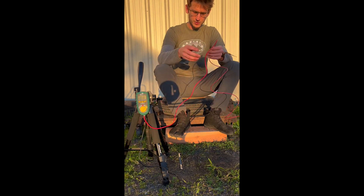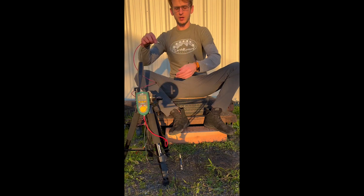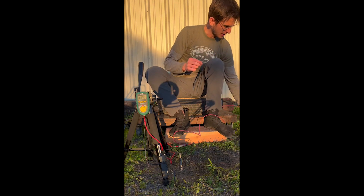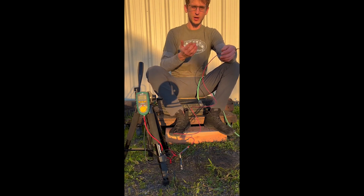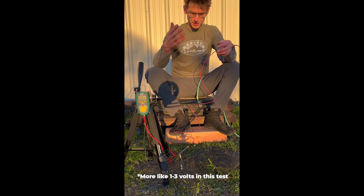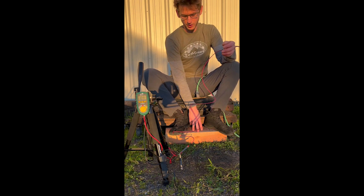To take this reading I have a voltmeter with one lead measuring the ground — plugged into the ground right there — and the other lead hooked up to a conductive brace I'm wearing, which measures the voltage of my body. This extension cord is plugged into the wall to simulate a 60 Hz EMF field, raising my body voltage to between three and six volts, as shown on the voltmeter. I'm sitting on an insulated platform with a car tire under me and a big wood block under my feet.